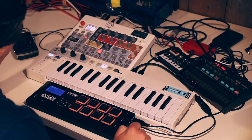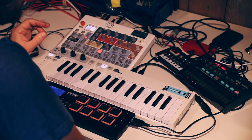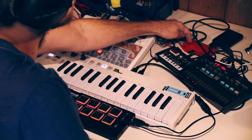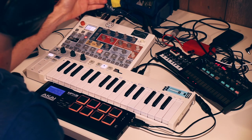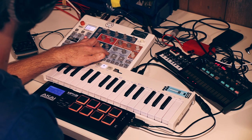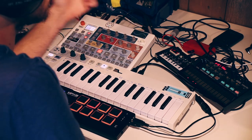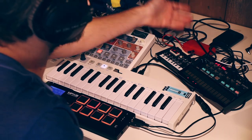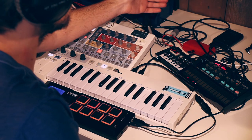That was fun. So you may have noticed, when I started hooking up the Volca FM and running things through this passive mixer, all the drums on the model samples lost a lot of their punchiness. They all sounded a lot more muted, a lot more quiet. I had to keep cranking up the volume on here. And the reason is just because I'm using a passive mixer here. It's just normal. Anytime you have a passive mixer, you're reducing the electrical signal, and therefore you're reducing the volume.